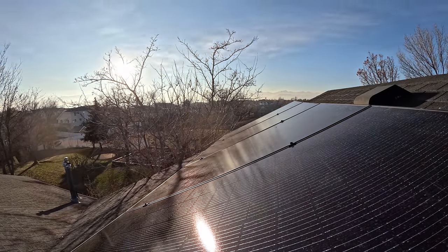One of the best parts is that since these batteries are mobile and not bolted to a wall, if my parents ever move or there's a bug-out situation, the batteries can easily come with them. However, one thing I've noticed is that when this unit is plugged into the house, the external outlets stop working — so that is one thing to keep in mind. I have my EcoFlow Delta Pro Ultra set so that we use solar power during the day, and the batteries charge up to be essentially off-grid all night long with all appliances pulling directly from the battery. My parents deplete about the entire 6 kilowatt hour battery every single night, which doesn't leave a lot of wiggle room for emergency backup power. So I'll just grab another battery, pop it into the stack — which takes about 60 seconds — and that gives us the extra cushion we're looking for. The stackable modular battery idea is phenomenal. EcoFlow also has a storm warning mode which can analyze weather patterns and charge up the battery so it's ready just in case of an emergency.